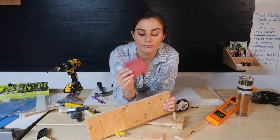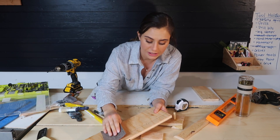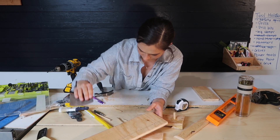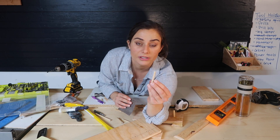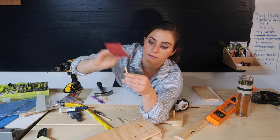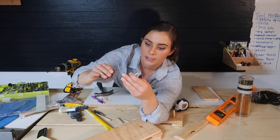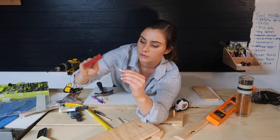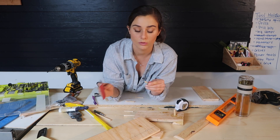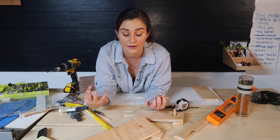Using a rough piece of sandpaper I scrape away the random wood chips sticking up so the dowel can go in easily. I do the same thing to the dowels themselves — there are little pieces of wood sticking out, so I go in with a really rough piece of sandpaper and clean them up a bit. They're not perfect, but I just get them cleaned up to where they can fit in the hole, and I'll make them perfect when I sand the entire thing.